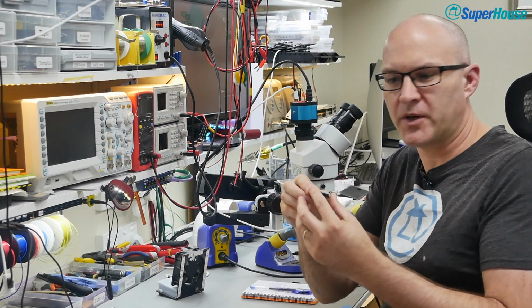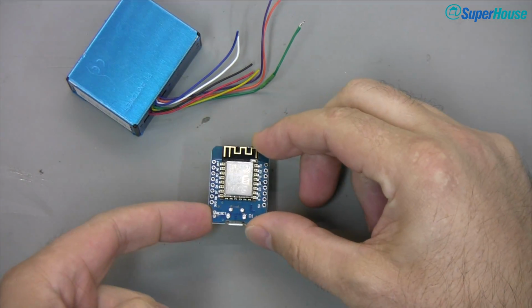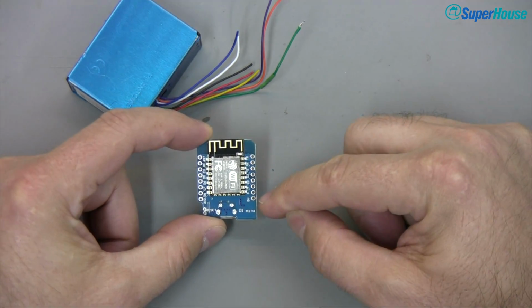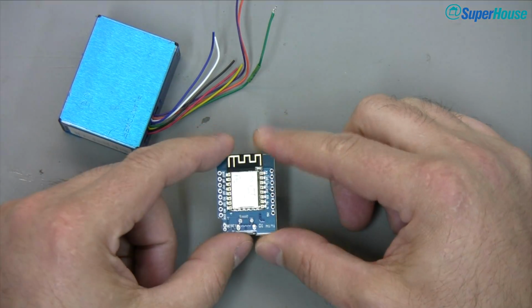So now we need to find the right pins on the Wemos D1 Mini for making our connections. Now if you have it oriented the usual way, so reset button down on the bottom left here and the USB pin towards you, there is 5 volts, ground, and we're going to use D4 to connect to the TX that comes from the PMS 5003.